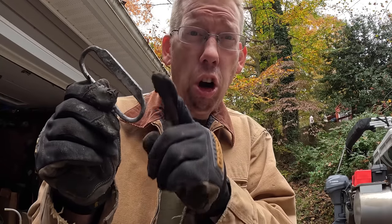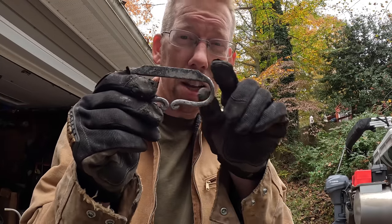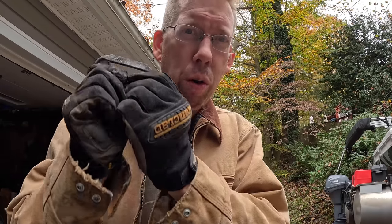In order for a flint striker to make a spark it has to be hardened high carbon steel. So you take this leaf spring steel and you heat it up until it's a bright orange and you dunk it quickly in water — that'll make it hard enough to make a spark. You can either do that in a forge, in a campfire, or with a torch.